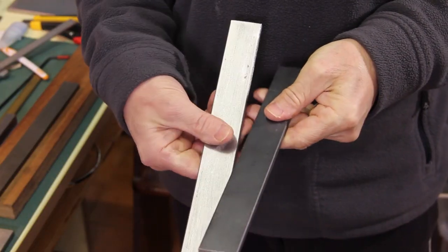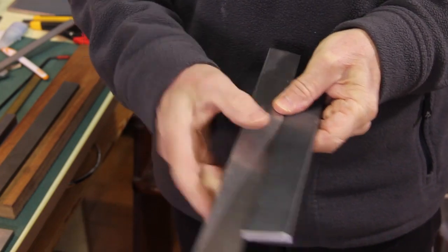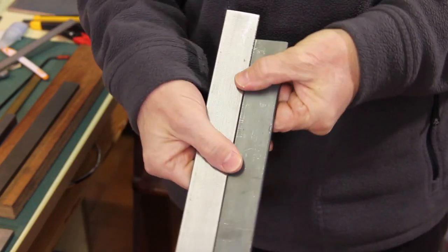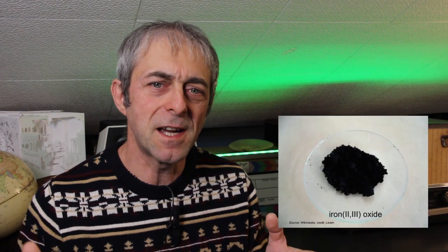As the name implies, hot rolled mild steel is made starting from a large billet that is heated to the point that it glows and then rolled or extruded through a die to give the desired shape. The hot steel reacts with the oxygen in the air and various iron oxides are created at the surface of the metal. Multiple layers of oxides build up creating a pretty thick coating with that characteristic dual grey-black color with a slight blue hue. The composition of the mill scale is mostly made of ferrous oxide, ferric oxide, and magnetite. Therefore it should be possible to let it react with some acid to remove it.